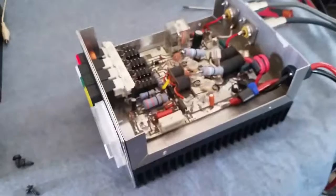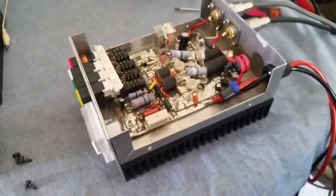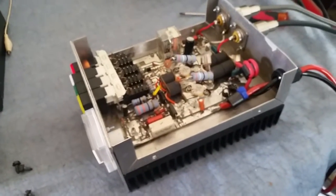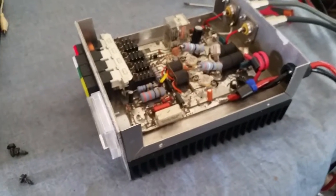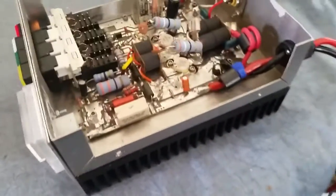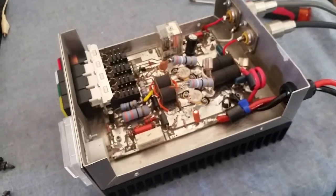With 8 watts drive on the thousand watt slug, that's about 150-160 watts RMS. I'm a little curious - I want to hook this up to a little bit more current and a tad bit more voltage. I just want to see if it'll do 200 watts. I know you won't mind, Andy. We're going to hook it up to the 100 amp unreg - just going to burp it.